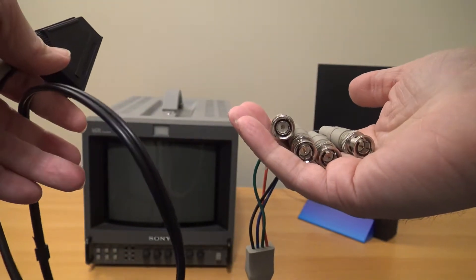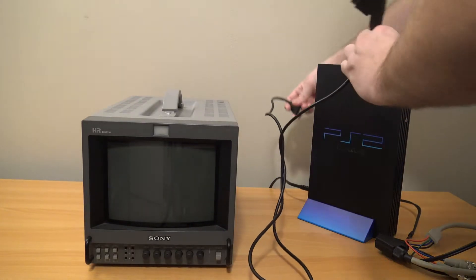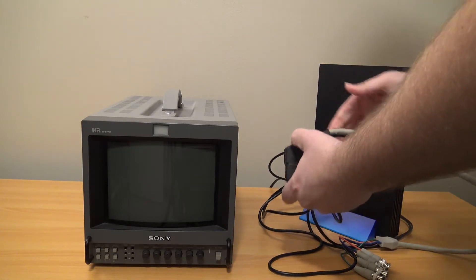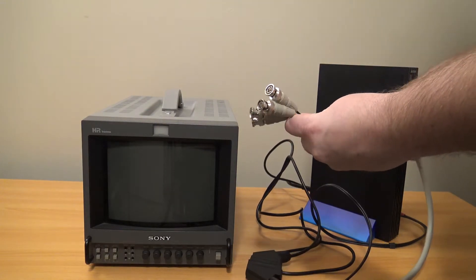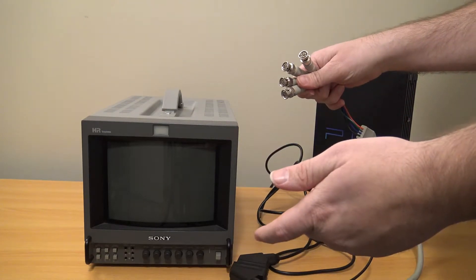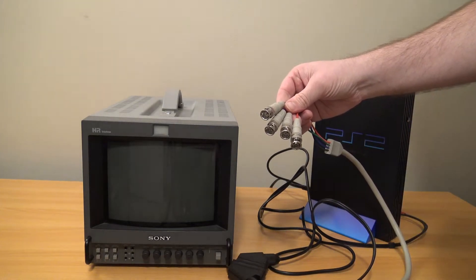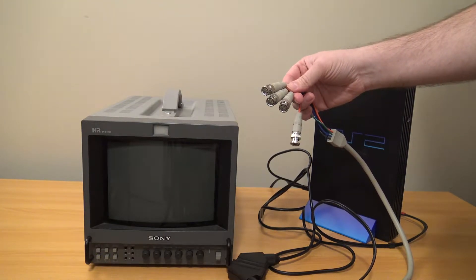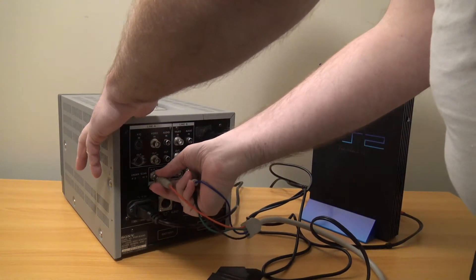So what I'm going to do is plug this into the PVM and show it off. First we'll just attach the SCART cable, then we attach the SCART cable to the BNC breakout adapter. Note, you've got to make sure you get the exact kind of adapter, and for certain PVMs and other devices you'll need a specific BNC cable that strips the one sync signal. Just know that you might need a different kind of BNC breakout with a different wiring depending on what units you hook up to this.